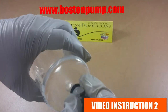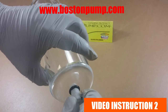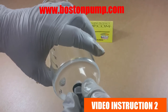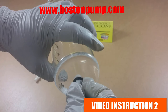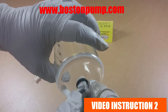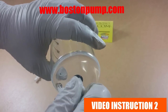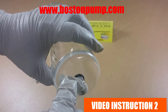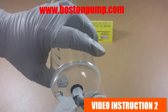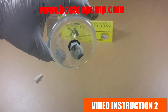Now we put a little bit of oil onto the threads of the cylinder using the Q-tip. Then we take the cylinder and go clockwise about four and a half turns. Make sure the coupling is positioned at twelve o'clock when inserting. Make sure you're not cross-threading — get the threads right. Go one, two, three, four turns. Once you reach four turns it will start to get tight. At four turns, go about a half turn or less — about 25 minutes — and the coupling will stay properly.